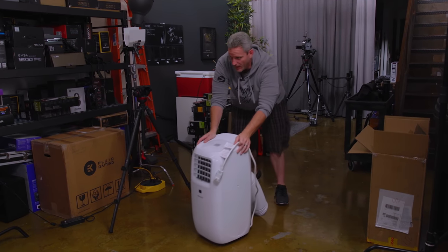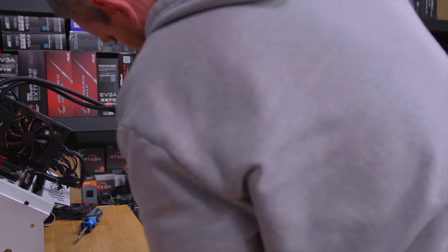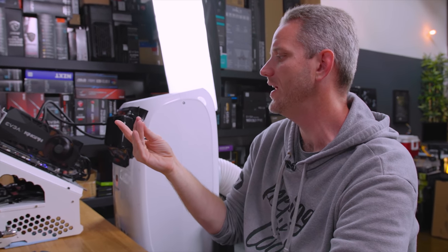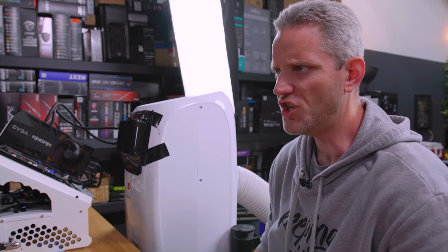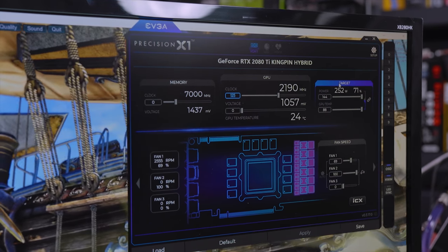This thing's heavy — it hasn't come out in a while. Around 14°C is where we're dropping, and condensation is under control because we're not far enough below the dew point to get any measurable condensation. It feels slightly moist, but there's nothing in the lines — it's not cold enough. Anytime we do this, people freak out about condensation. But that'd be like saying turning on the AC in your room is going to make the inside of your walls condense — and that's not how it works.